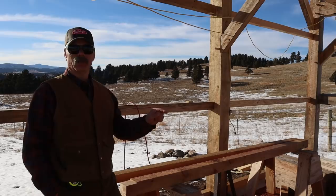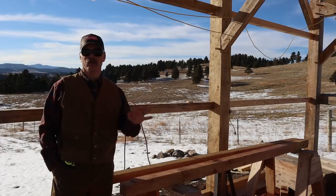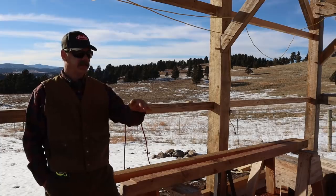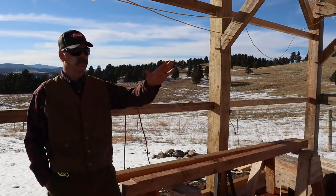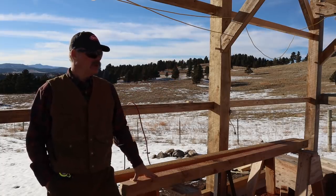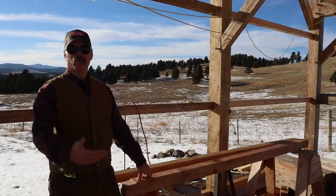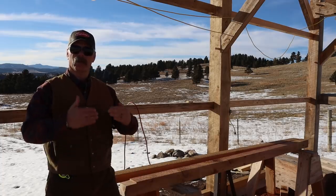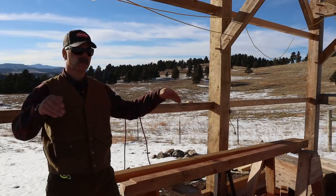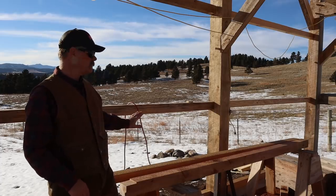And on this east side, I'm going to use some butyl weather seal tape on the bottom and outside, because that side of the barn is really, really close to the ground, and the slope is coming down into it, so there's a pretty good chance that those could get wet. And I'll use that tape to kind of seal up. I've got that butyl tape on the bottom of my posts, and it wraps up the outside just an inch or so, and then I'll put some more of that butyl tape on the outside of the posts, especially on this side. These posts over here on this side, I still have that, but it's not as critical.